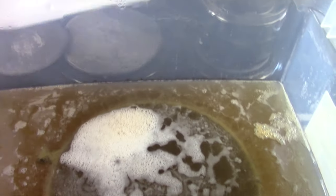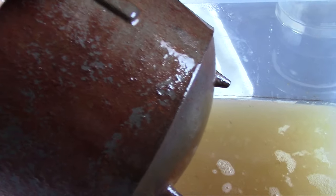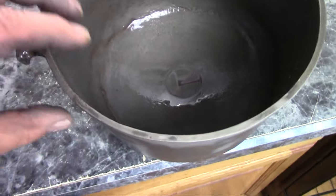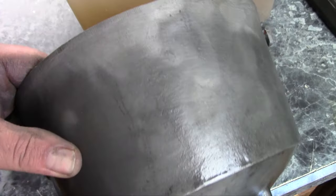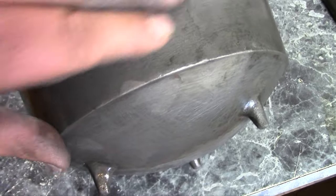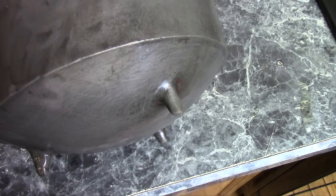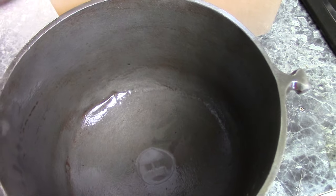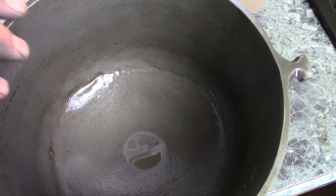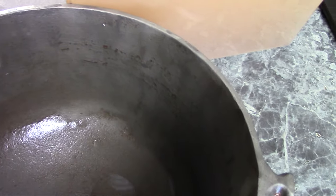A little condensation on my lid. This is just vinegar, so it's perfectly safe to just reach in and grab things. That doesn't look too bad. I scrubbed this off with a stainless steel scouring pad and a lot of that rust came right off. Something you'll notice when you soak things in vinegar is you'll get quite a lot of black residue — that's black iron oxide mostly, and it can be kind of tough to get off. A stiff bristled nylon brush and dish soap seems to work the best. Just drip some dish soap on it and scrub it with a brush.